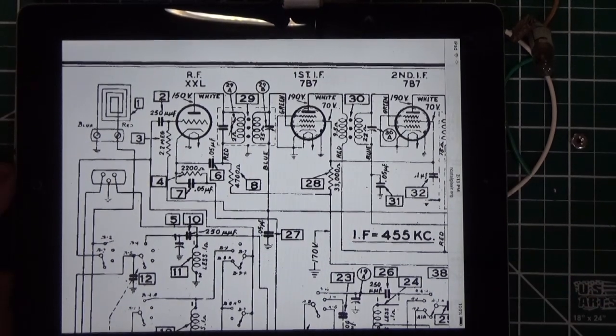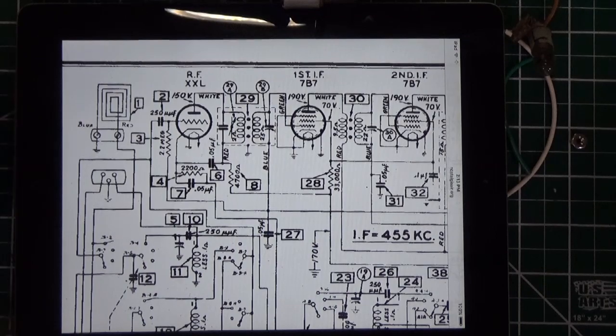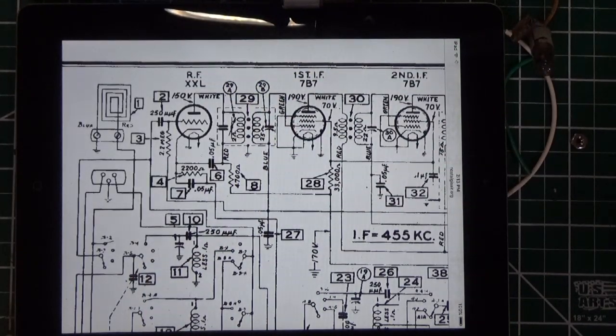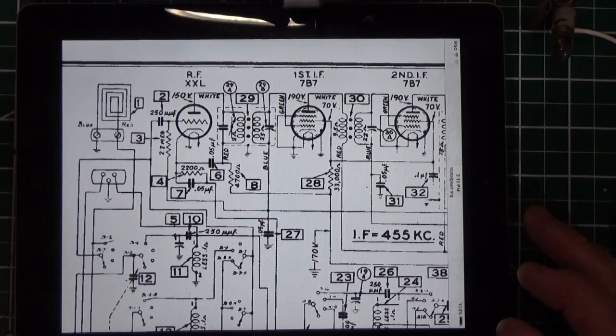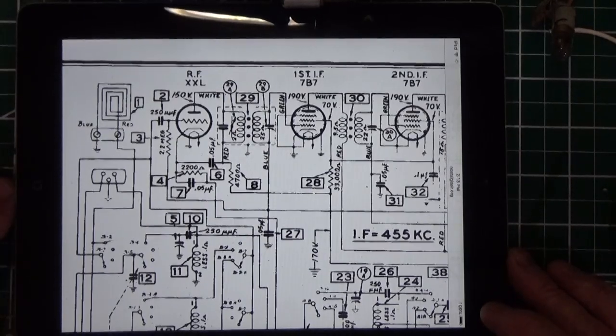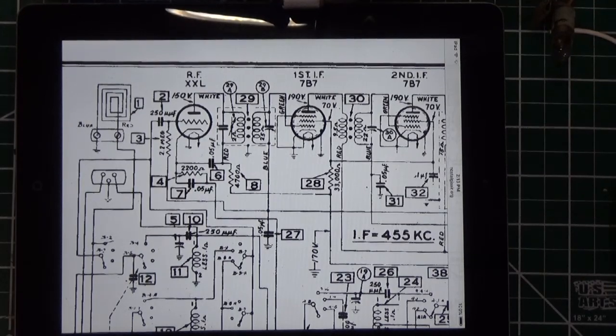And you remember I put in a yellow film cap, and if you look down in here, you could probably see it. It's right down there. And a couple of viewers noticed that that's not right, especially Doug Moslak, who said, "Hey, I'm pretty sure you've got to replace that with a mica cap." So the question I had was, well, why? Why does it have to be a mica cap? And it's all about precision.